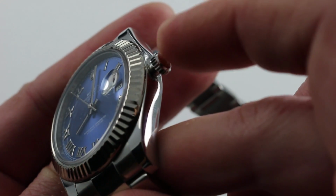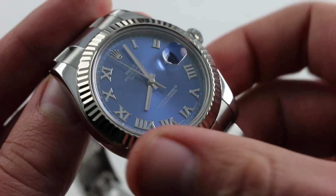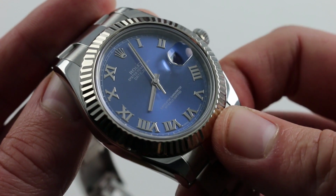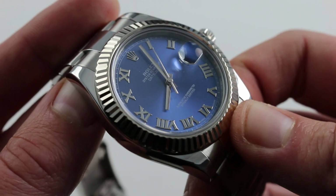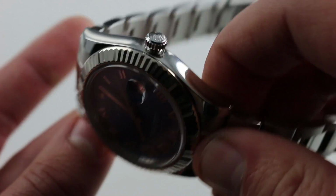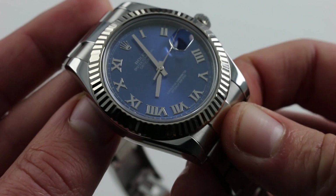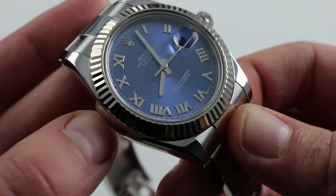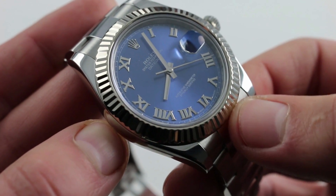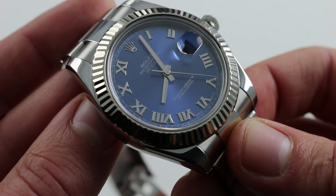The twin lock style crown endows it with 100-meter water resistance, so the watch can back up its sports watch pretensions. Moreover, it features an anti-magnetic Breguet overcoil hairspring made of material that Rolex calls Parachrome. The combination of anti-magnetism and resistance to gravitationally or positionally induced timing variation are the benefits of that hairspring. A full balance bridge anchored at both sides with a free-sprung balance architecture means that the watch is also exceptionally resistant to shock-induced timing variation.